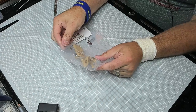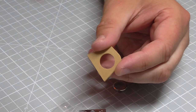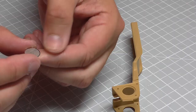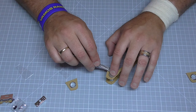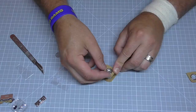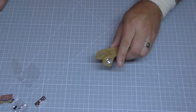Stage 59: we're working on the transmission tunnel. We're taking the right speaker mount and putting a bezel around it — just push that into the hole, flush all the way. Then we put a speaker grill inside: it's a little metal grill that drops in around the lip. We're then attaching what we've created on top — it's got three lugs to hold it in. Do exactly the same on the other side, and there you go, both sides in.